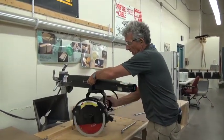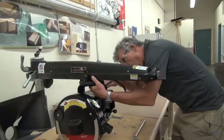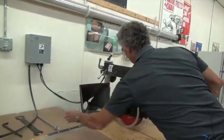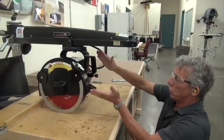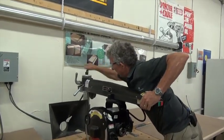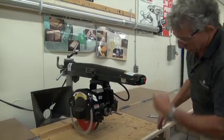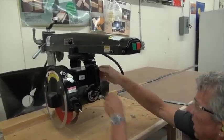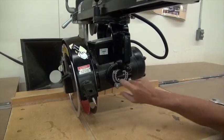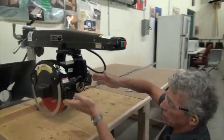Now we're going to lift the pin, go back in, and that locks it in place. I'm just going to tighten this up because it's good to have all your adjustments tightened before using it. Another thing you can do — we'll do this once in a while — you can tilt this. I want to raise this up, and here we see the up arrow, so I'm spinning it in this direction. That raises or lowers the blade. I could pull this pin out and tilt this, then lock it in place. We bring this back, lock it in, and that's at zero.